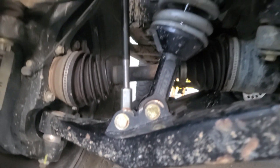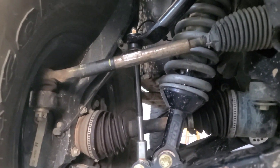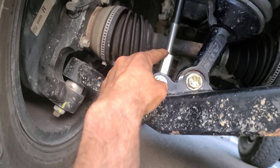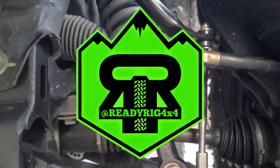I just got back from my first test run with the stock sway bar and the new links that I made - what a difference. It just feels so much better with the sway bar on. I was going 80, 85, 90 miles an hour on the freeway and it was solid as a rock. Turns are definitely way, way better. I think I'm going to take them out and extend the threads a little bit further so I can get a jam nut on there, and then I'm ready to go. Thanks for watching - like and subscribe as usual.